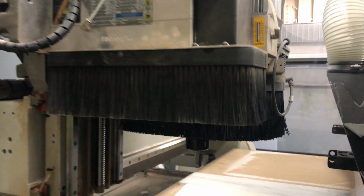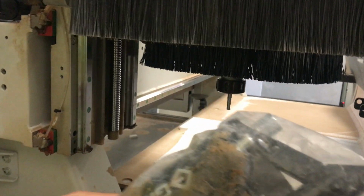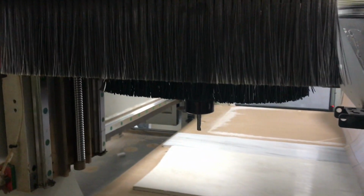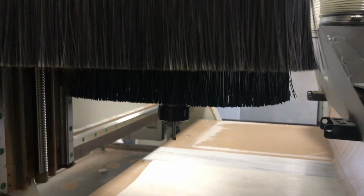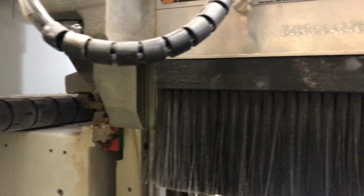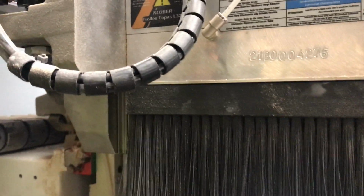The grease goes into the greasing gun where you have a fitting and you can just pump it inside. How many pumps? It's going to be 1 pump each every 40 working hours. Do you see it coming out any place? Or you just do the 1 pump and you're good? Just the 1 pump. Right.